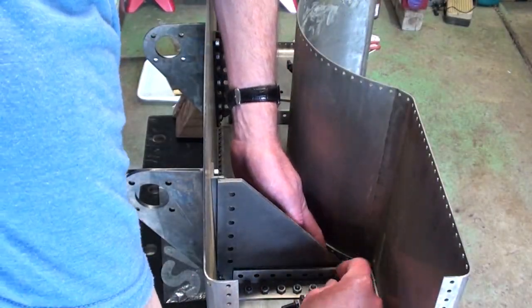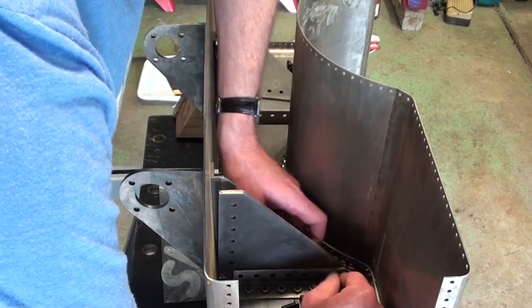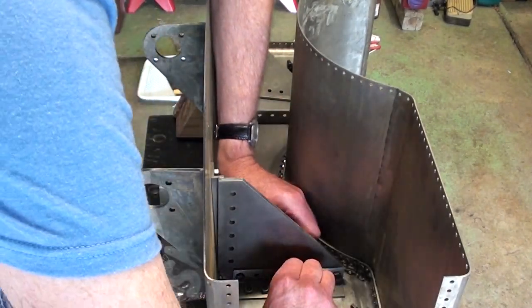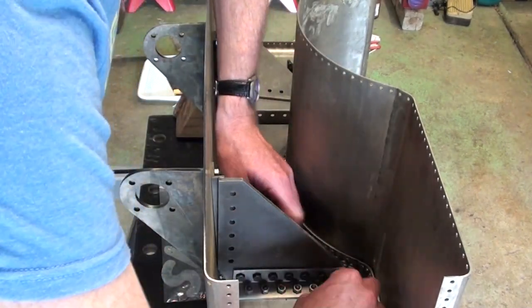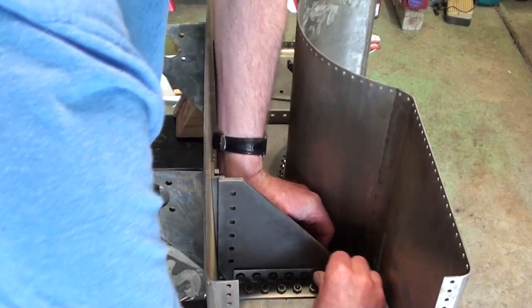The internal bracing brackets were added. During the test assembly, we noted the steering gussets did not sit fully perpendicular to the bottom panel. We verified this again at this stage of final assembly and noted no change. Knowing the steering shaft would be supported by bearings mounted to these gussets, we thought it important to correct the misalignment as much as possible.